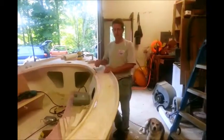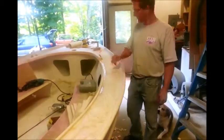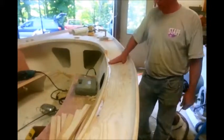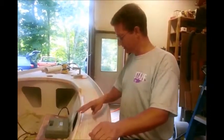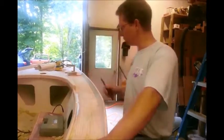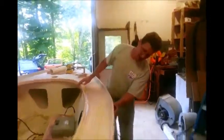We got a little carried away working and forgot to tape, but here's what we did: we gave the woodwork a quick hand sand and laid this piece in along the side of the cockpit, stretching it from the combing all the way back to the stern of the boat. That piece is going to catch any water that splashes up onto the deck and reflect it right off the back, keeping it from running in down your back into the cockpit. The next thing we have to do is fill our nail holes, and then we're going to come back and put some stain and varnish on our framework — this piece and this piece — and our rub rail down here.